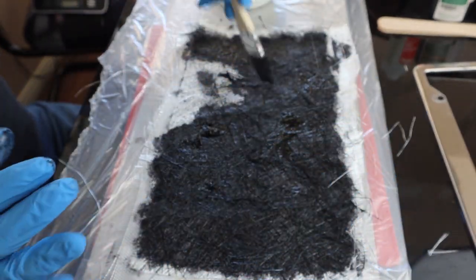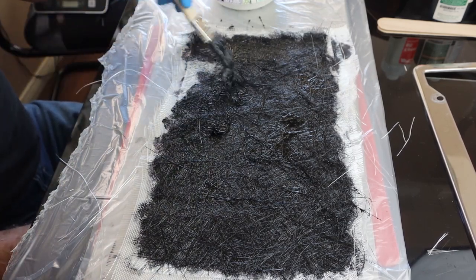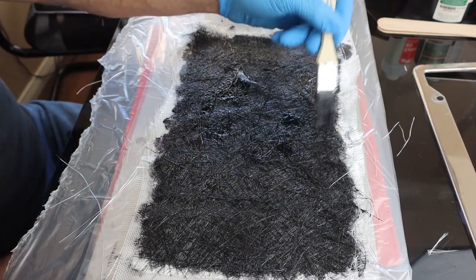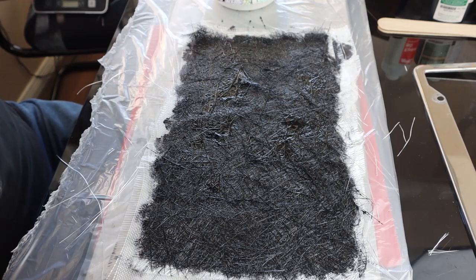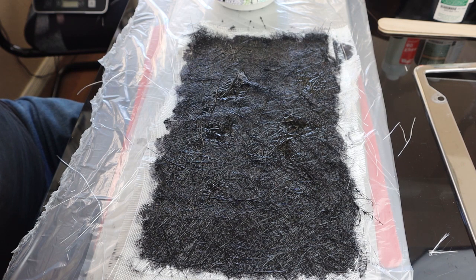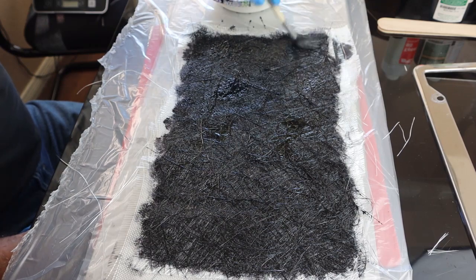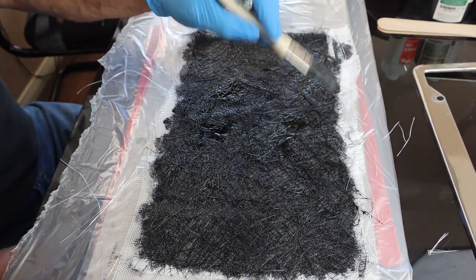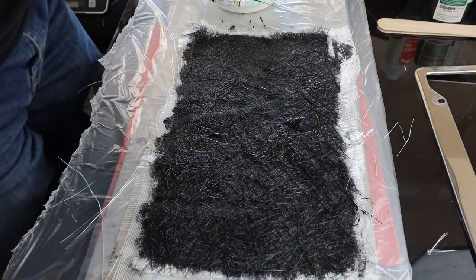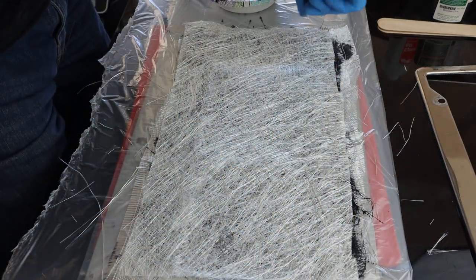Normally with a thinner resin system it won't fray so badly. When the resin is spread thin on the ply of fiberglass it takes longer to cure; when it's thick in the bowl it cures faster. That's why you want to get the resin spread out as thin as you can. Always double-check your coverage. We can now take our final ply of chopped strand mat and mix up some more resin.